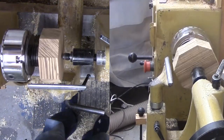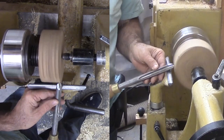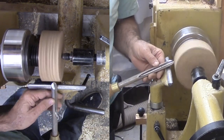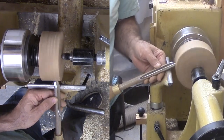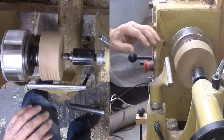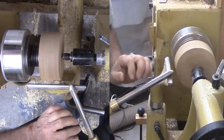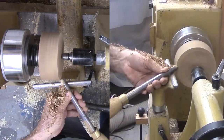The last set of wedding ring holders I made from olive wood, which has a very dramatic grain. This time I chose Zebrawood, which also has very dramatic grain figure. I purchased some 8/4 wood, 6 inches wide and 2 inches thick. For this ring holder, I cut off 4.5 inches, then cut off a 1.5 inch slice for the center spindle, leaving a 4.5 inch square for the bottom tray.